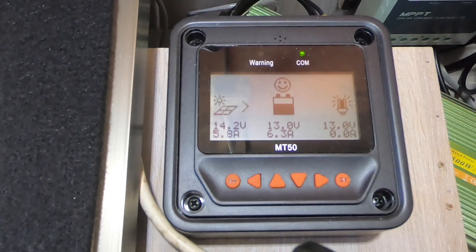We're now going to plug the second solar panel in and see the difference it makes. Wow — we've jumped up to 7.8 amps. We've now got 8.5 amps going into the battery, and at the moment, as you can see, there's no load on the battery because the fridge has turned itself off. What a fantastic jump in power — that's really going to help out during the day.